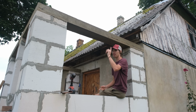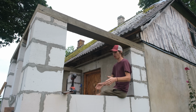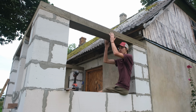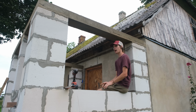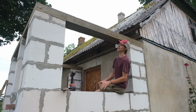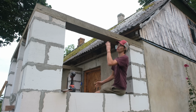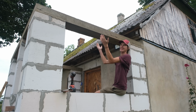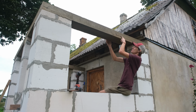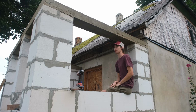That's what I did kind of with my machine when I made the concrete block. I was vibrating with the impact gun, but that cannot be done here or it's just gonna, you know, destroy something. I was vibrating against the metal. So yeah, other than that, of course those ones you just patch up, like you clean it up, and the strength of it is not really bothered. It is 20 centimeters thick, and just having these little holes is definitely not gonna make a problem.